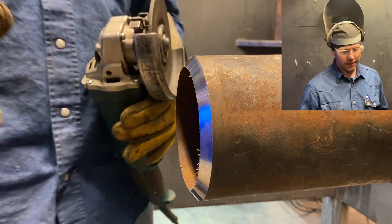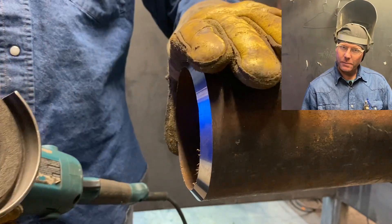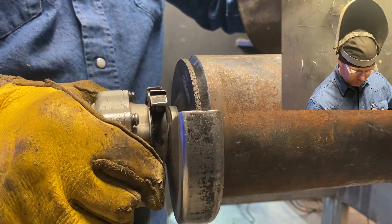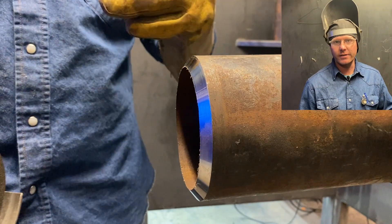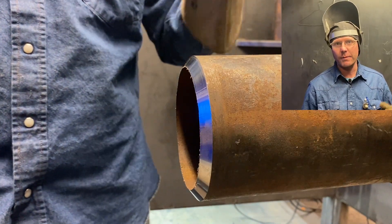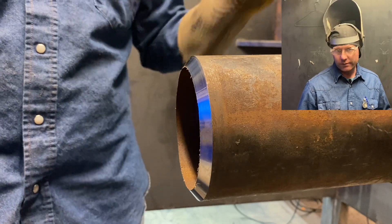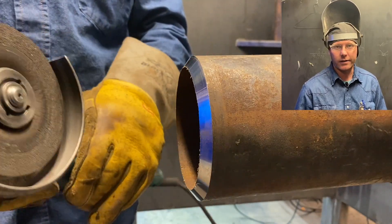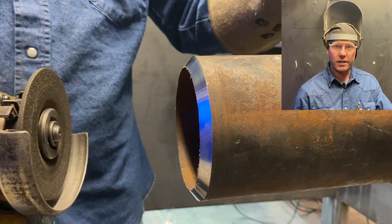There's a trick when you're grinding the land on your piece of pipe. You got a four inch piece of pipe, you take a four and a half inch grinding disc and you set that on there just like so — nice and flat — and that'll work with any piece of pipe within reason. If you got a six inch piece of pipe, grab a seven inch disc. If you got a three inch pipe, four and a half inch. Four inch you can use five inch, and so on until you get out of your grinding disc ranges. I'm going to grind this up real quick and I'll show you just how nice it turns out.